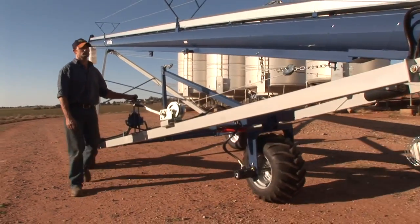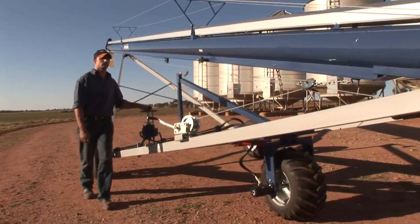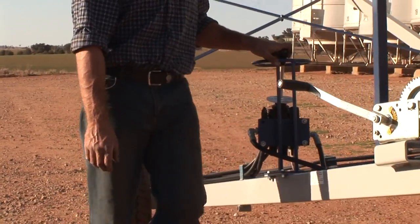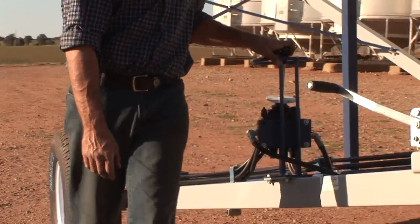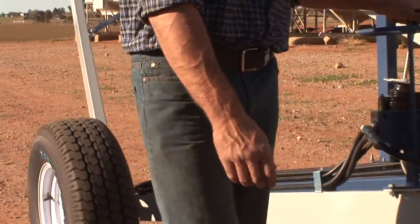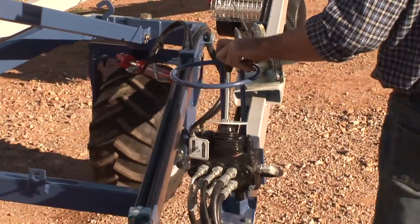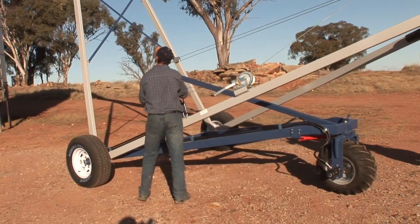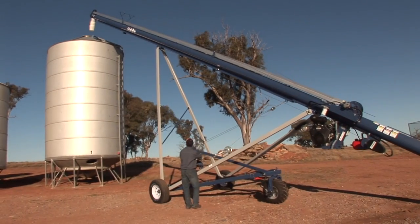The auger is propelled by a large, deep-groove lug tyre on the third wheel, which gives very positive traction. Being operated by a single multi-valve joystick makes it very simple and pleasant to operate from a safe central location. The steering of the drive wheel enables accurate positioning of the auger and provides gentle and smooth control.